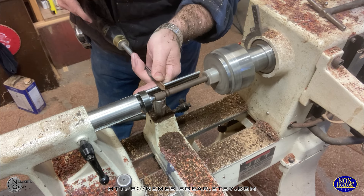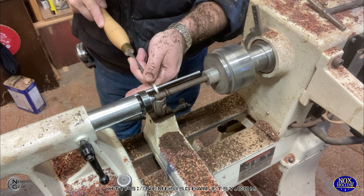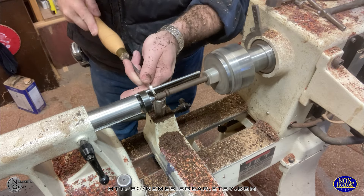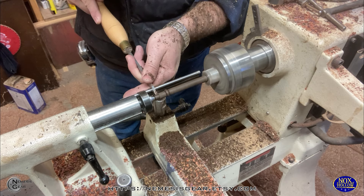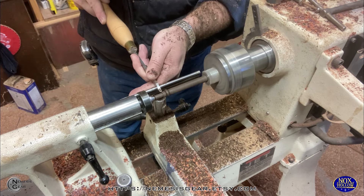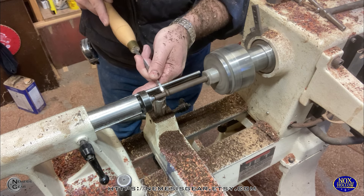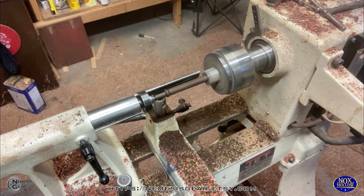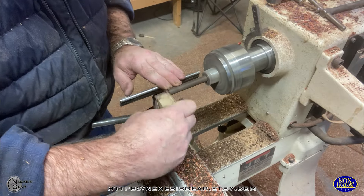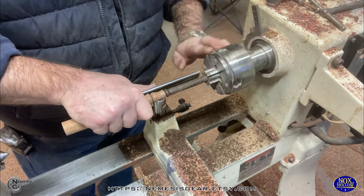I'm putting a little bead right there where this is going to glue up, and I think that's going to be a nice match. I've got to turn this tenon down to the right size — I'm making it just a little bit bigger than the hole because the parting tool I'm using can take it off really fast. It's a lot easier to get it really close and then bring it down with just 150-grit sandpaper, which is kind of what I did. You can see it's really tight — it just barely rotates in here.